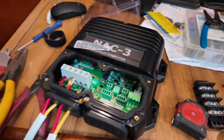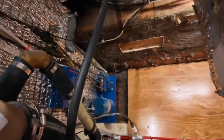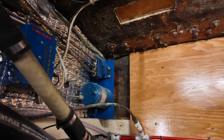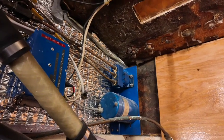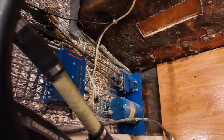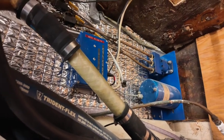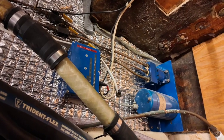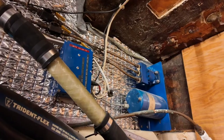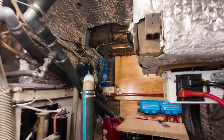I'm going to connect all these wires and the little terminal blocks, then slap it up on the wall. I'm going to use a little battery selector switch that has two positions for two different battery banks — it was the only three-pole switch I could find rated for 30 amps or more. This one is actually rated for 300 amps, which is plenty. We can mount that on the wall and still have everything transferable with just the flip of a switch — if the new autopilot goes down, the old one comes right back.